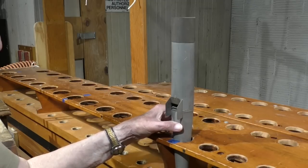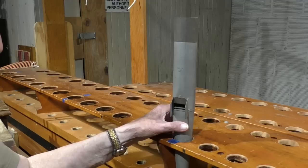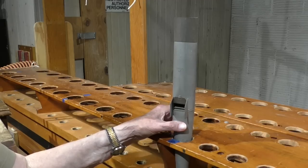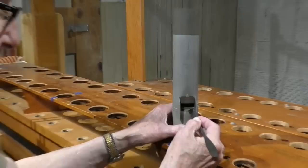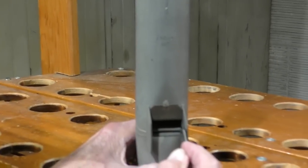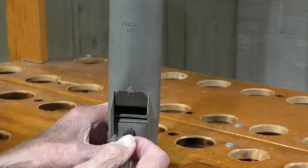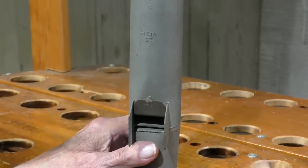Now, one thing that I found interesting that you talked about was how it appears that they voiced with the double languid in place and how they cut it back. Well, it almost had to be on air, and as the pipe construction shows, the languid was actually added all the way to the lip in the front. And as the men were working with the pipe, they would scrape this thing back until the bloom started to form. This creates a little suction vacuum, in a sense, into the back of the pipe.